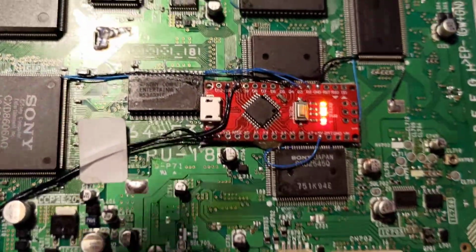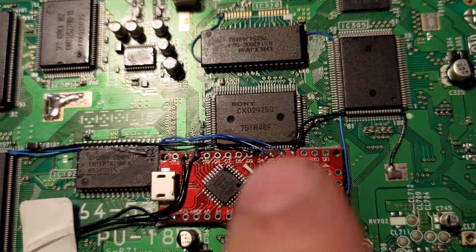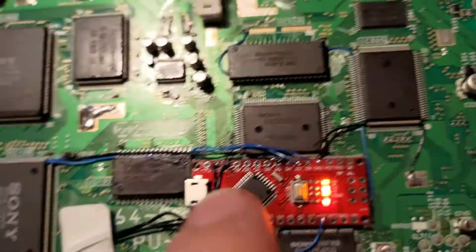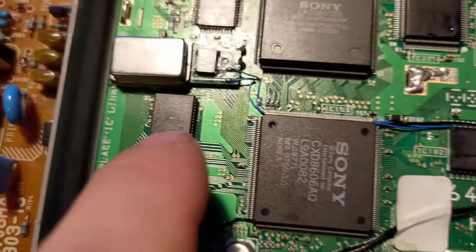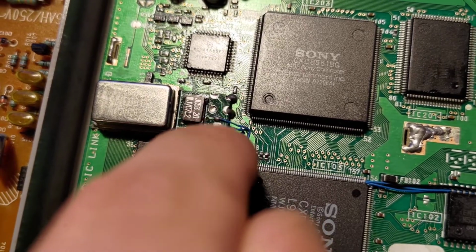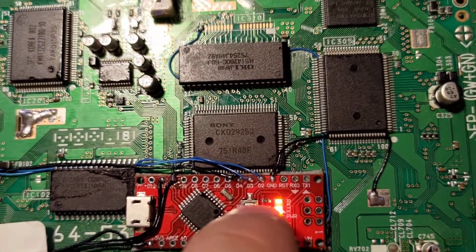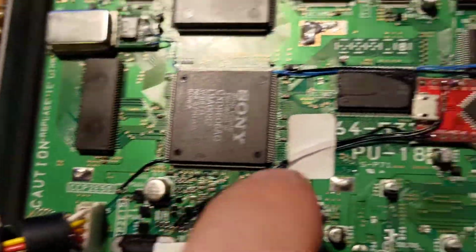And then the way it's currently set up in the source file is 2 and 3 for the crystals to power either one. It doesn't matter which one's which. They go to the outside pins here. The middle one's for if you want to use a manual switch, so leave that blank. That's got 3.3 on it to either swing it to that side or this side. And 4 is your reset, which I pointed out before.